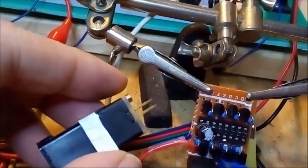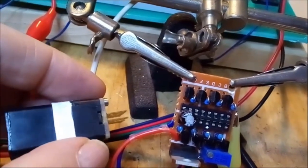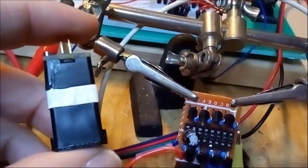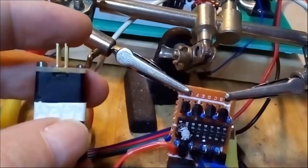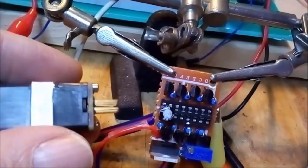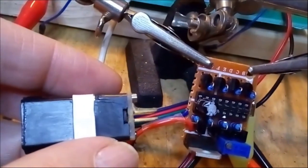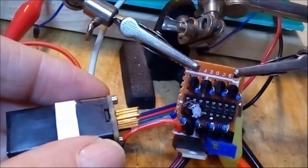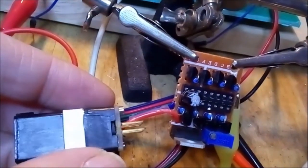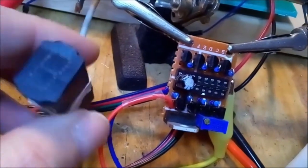So when you screw it back together, you have those little screws at the bottom. You should not put more tension on the screw than is necessary to keep the three parts of the display element together, okay? So as soon as they seamlessly fit together, you should quit putting more tension on the screws, okay? Because if you do, you will crack the housing, as I noticed myself. There is a way to repair that, and that's with super glue. I didn't do that just yet, but I'll put a dab of super glue onto the crack, and I think that will do to repair it. In any case, these are quite brittle, okay?